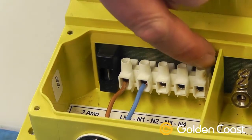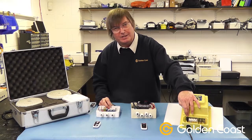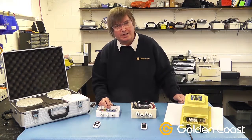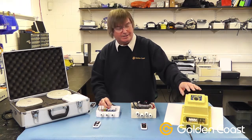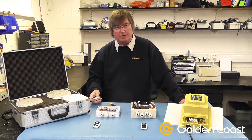For the lowest voltage setting, we only want 12 volts for the LED lights. Quite often these have been upgraded to a higher voltage to allow for the halogen lighting, so make sure that the transformers are on the lowest setting if you use existing transformers.